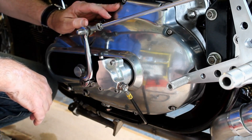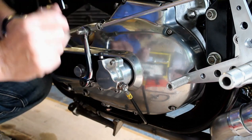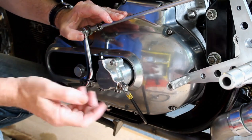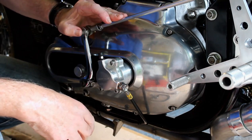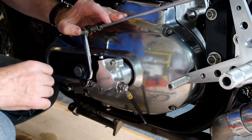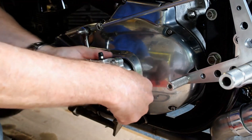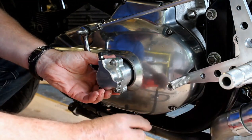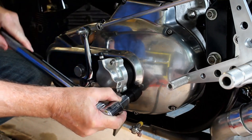To fix it I'll have to remove the whole thing and take the adapter back to the workshop to have a tiny amount machined off the face where it hits the case. I don't know how much to take off, so it'll be a case of take off a thou, bring it back, try it. I don't want to take off too much or it'll rotate too far the other way. So the whole thing comes off again, off to the workshop.